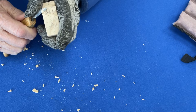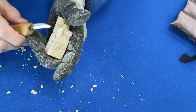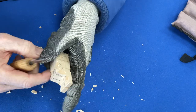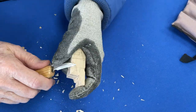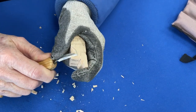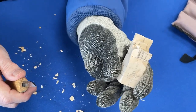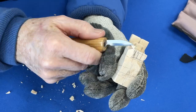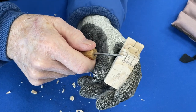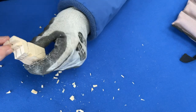I'm cutting against the grain now - that's a good example. The wood split right there because it's saying don't cut me that way. You can tell the wood fibers are broken. But if I cut toward the grain, watch how this smooths up. There's a smooth surface - that tells you this grain wants to be cut this way. Sometimes you have to cut against the grain; if it's still rough you can sand it out.